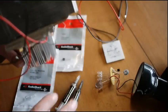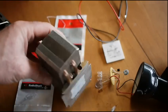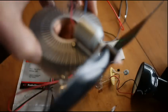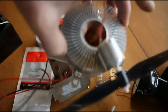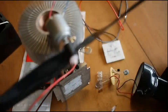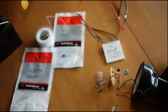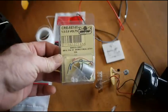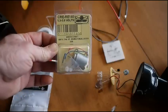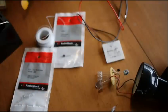So that's our generation unit, and that's all there is to it. I've been playing with fans as well. To make a fan, I do the same thing — I just stand that guy up, put the TEC there, and then I've made this little fan heat sink assembly, and I just set that right on top. The TECs make very low voltage, extremely low, but I was able to source these little motors on Amazon and that'll actually spin pretty well just off the TEC and run that fan just fine. So that's a neat way to make yourself a little eco fan — you can just wire that TEC right to the motor.